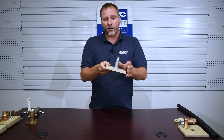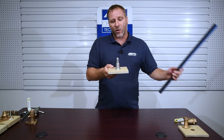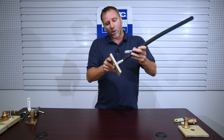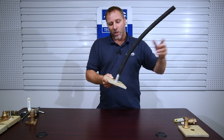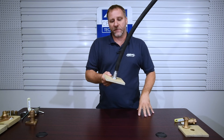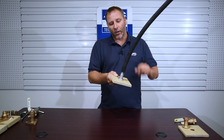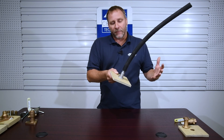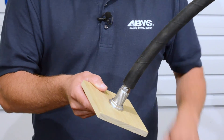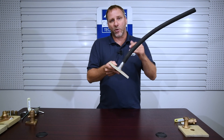Once we start going down below the water line, this would not be a great application. You would have this hose coming off this fitting underwater, and if anything should happen with this hose or any of the system down below, you have no way of shutting the water off — so that becomes a problem. The second thing is this part is sticking out so long. We've got to make sure this setup can handle the 500 lb static load test. Basically, we want to make sure that if we step on this or something hits it, it doesn't shear off. And there's a good chance this is not going to pass that, so this is not something we want to mount underwater.